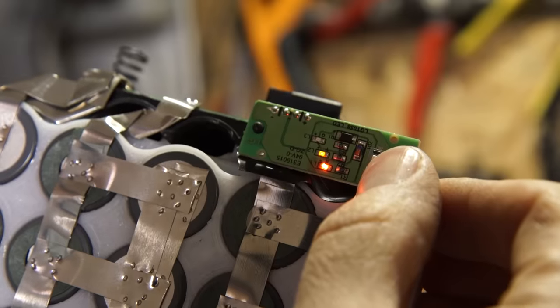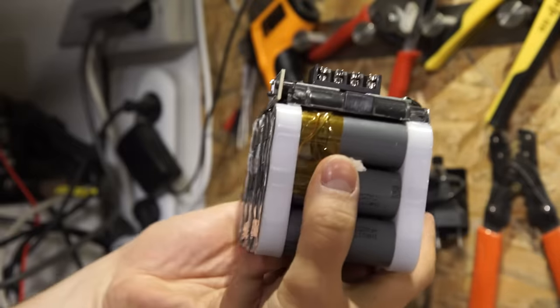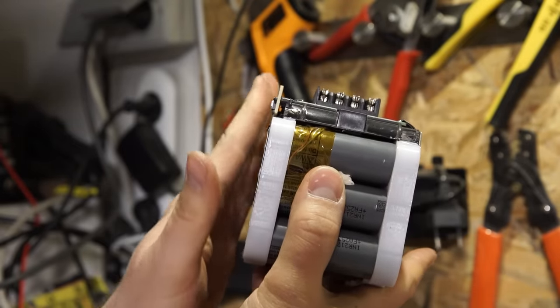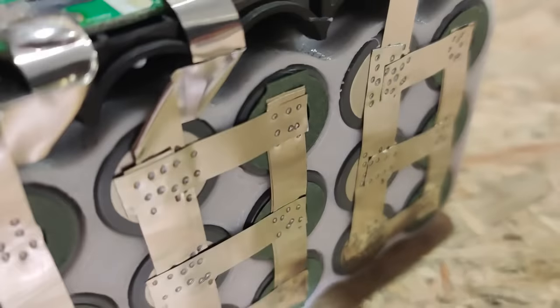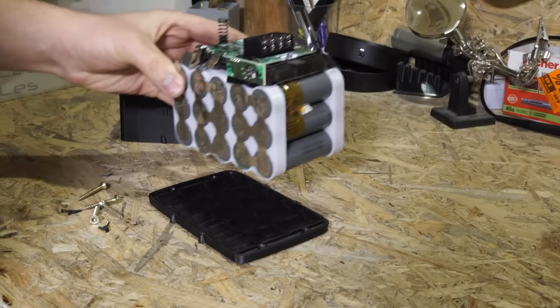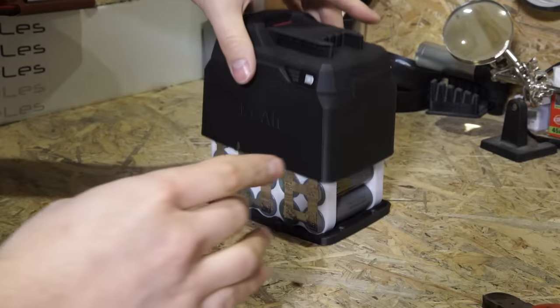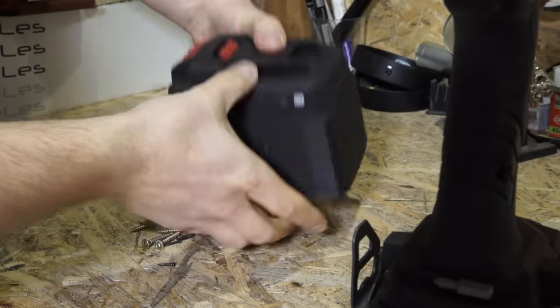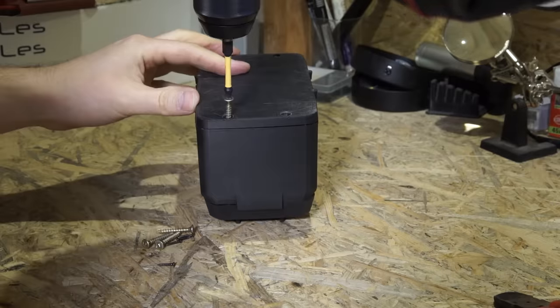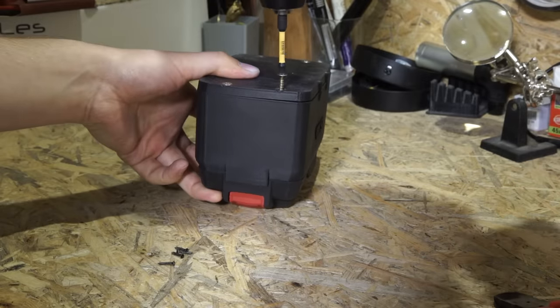And there we have it — a working battery. Totally finished. As you can see it has a very slim profile on the sides with these nickel strips. We almost made it to the finish line — only need to put everything together now. Make sure the cell sits snug into the base. The cover itself should just slide over without any friction. Put screws in — careful not to over-tighten these because it's only plastic you're drilling into. Last up the little side screws. And done.